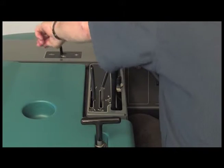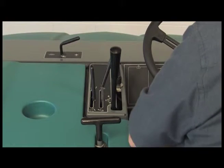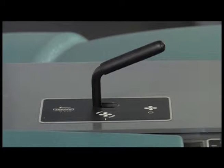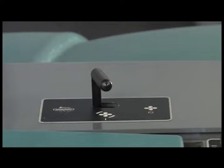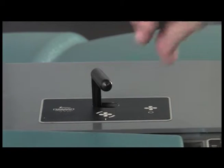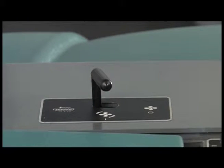The vacuum fan duct and filter shaker control lever provides operator control of the dust control and filter shaker systems. When the lever is to the right, the vacuum fan duct is blocked and there is no dust control. When the lever is in the middle position, the duct is open for normal sweeping with dust control. With the key on and the lever pushed and held to the left, the dust filter shaker motor runs. The shaker motor should be activated often in dusty conditions and each time before dumping the hopper.